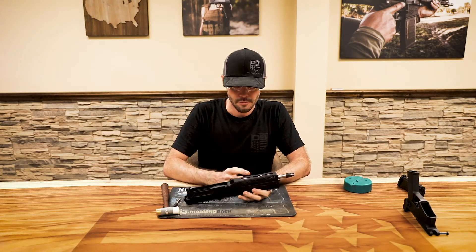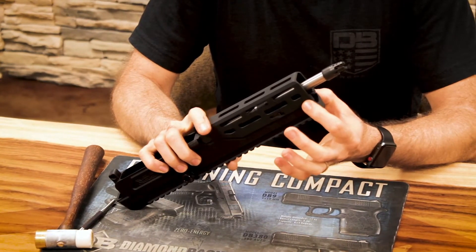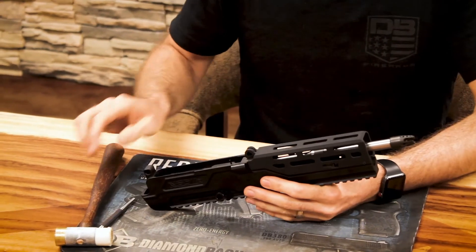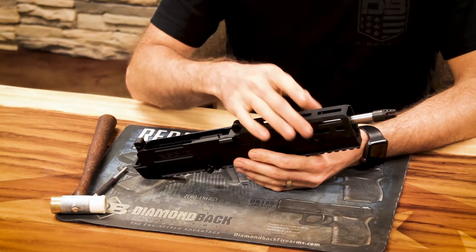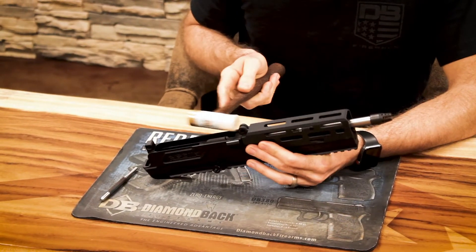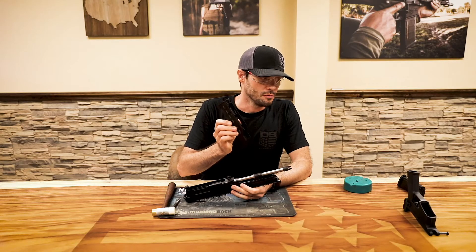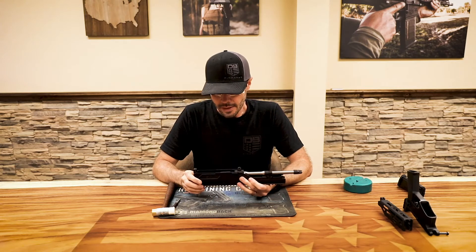At the front of the handguard there are two roll pins. Those need to be slid forward enough so that they clear their retention fingers on the upper receiver. This is kind of tight because it's what constrains the barrel in the upper receiver assembly. Just take your hammer and tap that forward until it clears, then it becomes loose and you can just lift it up and off. Nothing to disassemble further on the handguard, so set that aside.